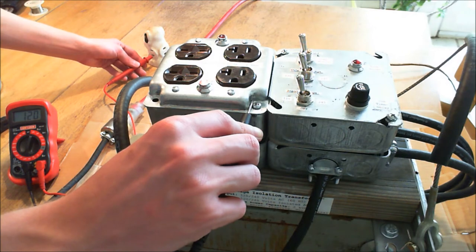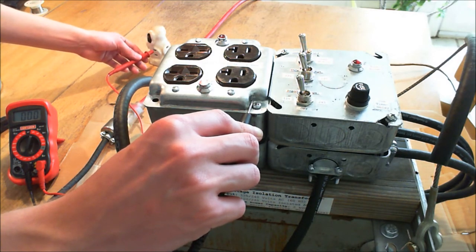Now that I've confirmed the multimeter is working, I'm going to verify again that there's no potential between this hot and this earth. As you can see, there's not. And what I'm going to prove now is that this chassis is in fact earth-grounded. I'll connect one pin to the chassis and the other to the electropup, which is mains — you can see 120 volts between there. And if I connect it over here, you'll see zero volts because that's the neutral.